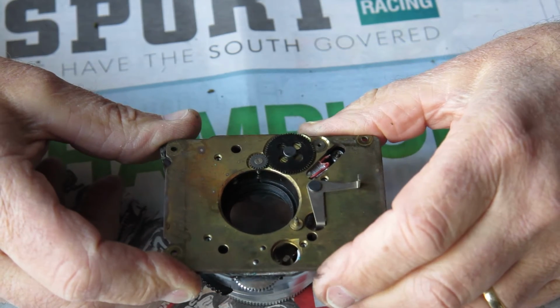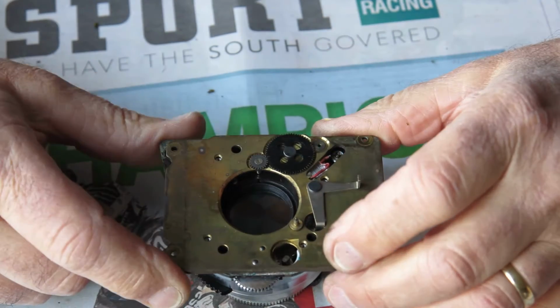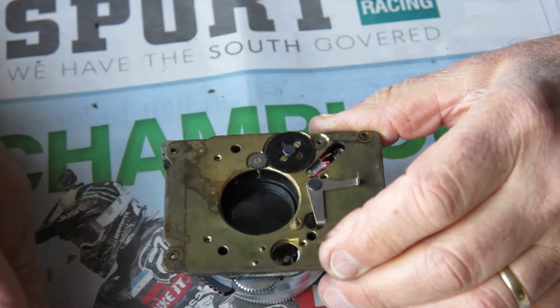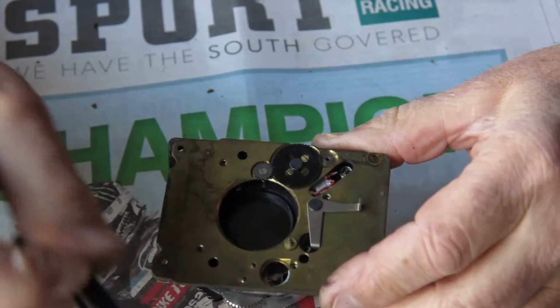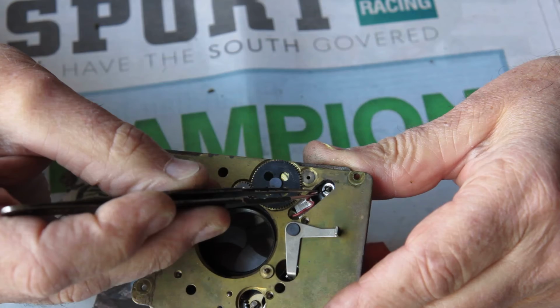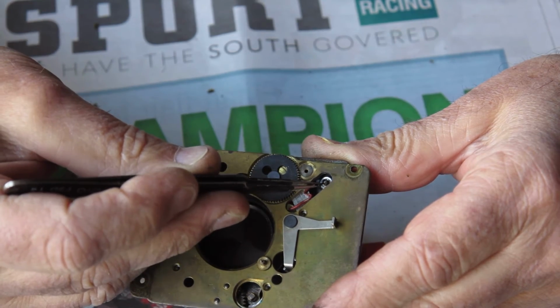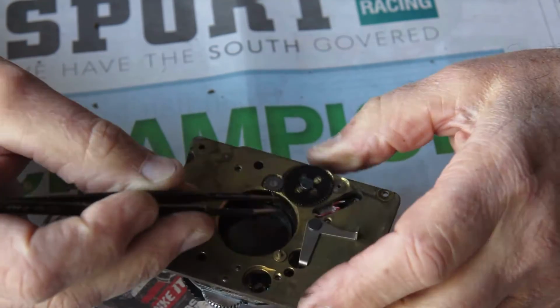Just looking at this now, we know that the four screws had fallen out of the back here, which holds that in place. I can see that this has been repaired before and someone has mucked with the soldering at this point. Typically you do not disturb the soldering for the flash contact at that point.